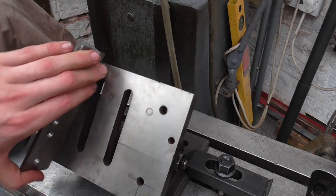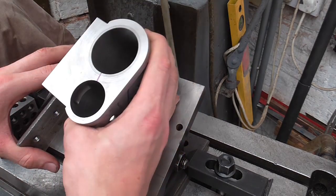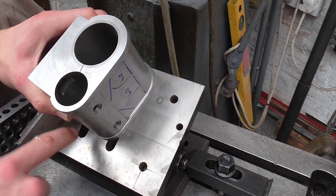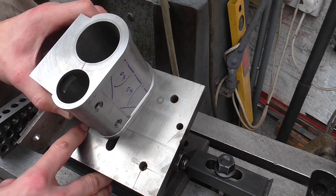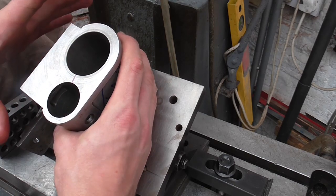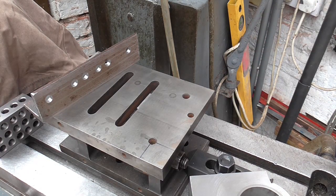I've taken this piece of angle that someone at some point has machined square, and I've put some holes in it — that allows me to get three screws along the length into there. I can then get a stud down through this bore into that slot, and in this slot I'm going to put a little stop that I can slide up to. That'll do two things: one, it'll stop the block trying to slide down during machining, and two, it'll allow me to switch the blocks over without having to reset up when I come to do block number two.